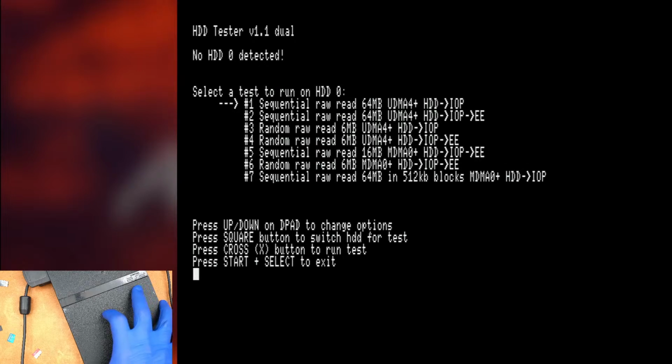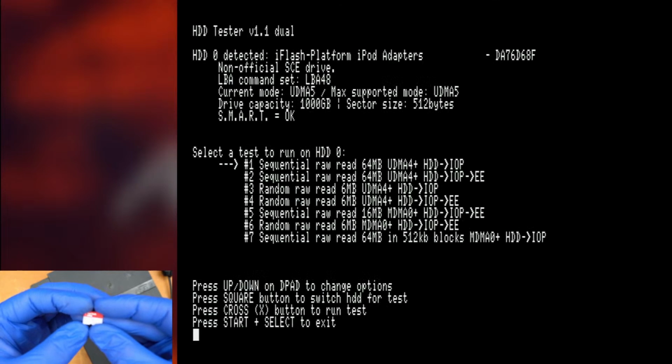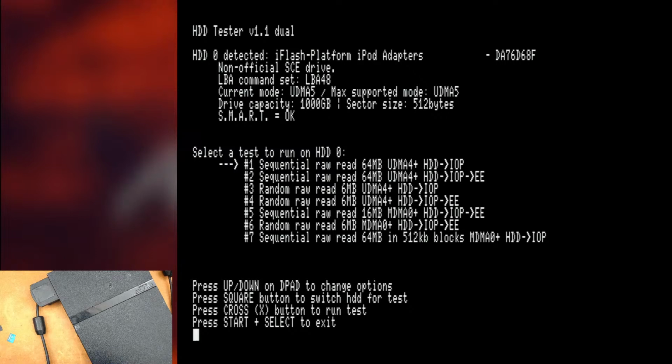Yeah, it's not playing ball today. So yeah, I'm confident in saying that SanDisk cards with the Micron memory, so the 1 terabyte and the 1.5 terabyte, they're not going to be compatible. Now that may not apply to the A2 variant of the 1 terabyte card, because I don't know if it uses that same multi-layer Micron memory. This is the A1 speed card, and it seems to use the same type of NAND that the 1.5 terabyte does.